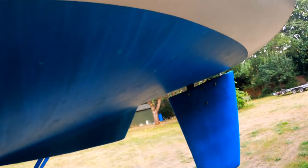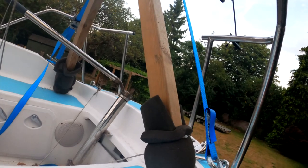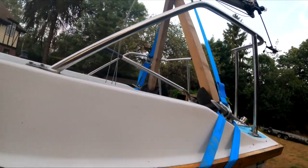The last real problem was with the rudder. There's an entire mechanism in there — a bunch of UJs and stuff running down, all stainless steel with a massive shaft in the middle. You can see my rudder comes up, and at the back of the boat there's a big shaft going down with a kink at the bottom and some UJs. There's quite a lot of resistance in there. When sailing I can take my hand off and it holds its course, but if I fell off the boat it won't right itself into dead wind very well — it'll flap around. It's also a little bit hard to push around. There's some sort of resistance, maybe a pin on the shaft — I need to take it apart and have a look.